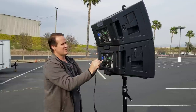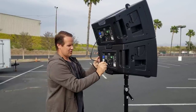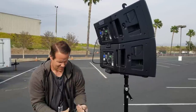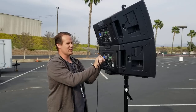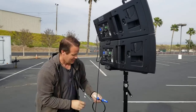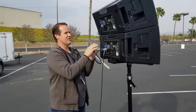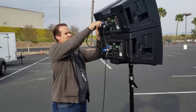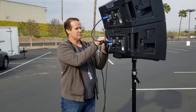With the connections, you just go in and out of your speakers, feeding it from the ground up like you normally would with the other speakers — just these ones go on top. The power uses the PowerCon connectors, which are color-coded in and out. Feed the top and the bottom, and here's the power cable for the bottom one.